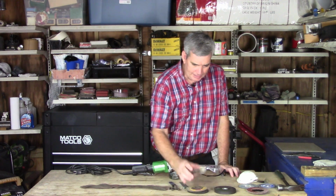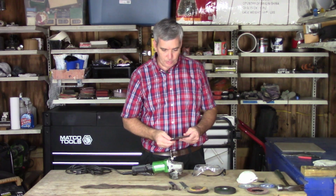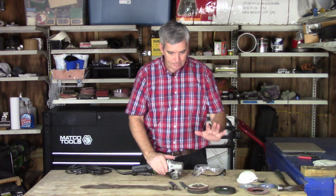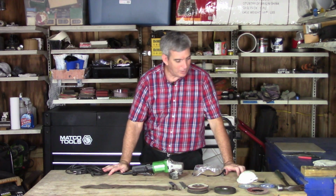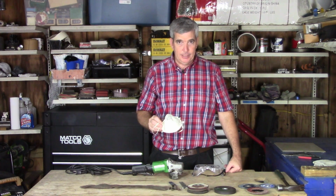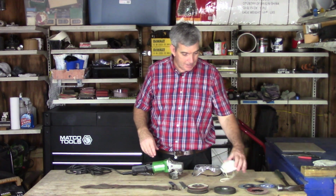And then I was reading on these grinder wheels. Some of them say before the first use, spin it for a minute or spin it up to 3 minutes before you use it. Okay, now, that's all I want to say about the safety aspects of this. Oh, one last thing. Whenever I'm cutting masonry with this, I wear a dust collector too, and I like to have the shop vac real close, and you'll see why in a moment.